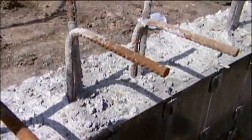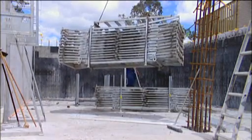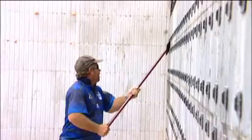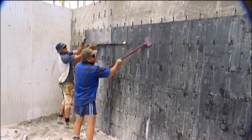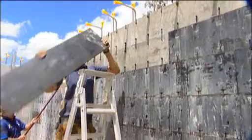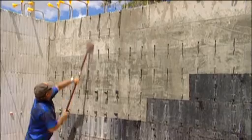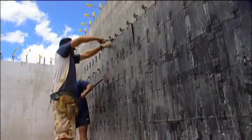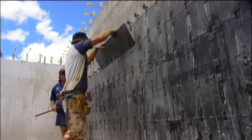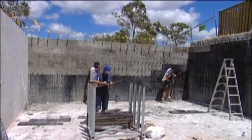Now that the concrete has cured, you can remove the wall brace scaffolding and stack end to end with ladder on top and place in an accessible area for removal off the site by crane truck. To strip the reform, snap the plastic ends off the recycled plastic interconnects with the use of a floor scraper. Care should be taken so as not to damage the reform — the more care, the more reuses of the reform you will achieve. Inspect and clean the reform panels and stack ready for the next use.